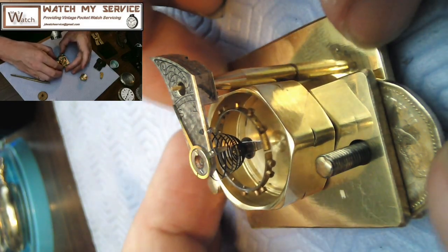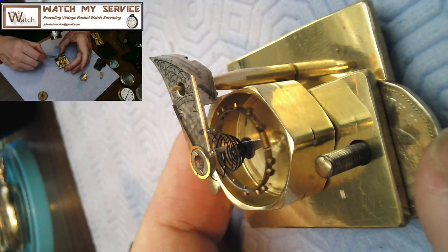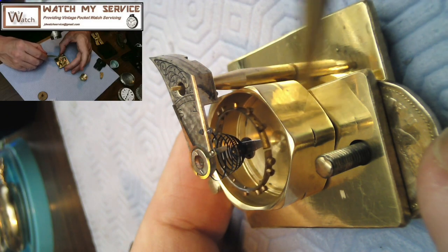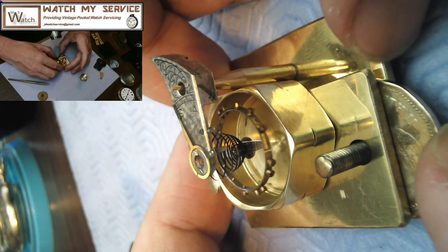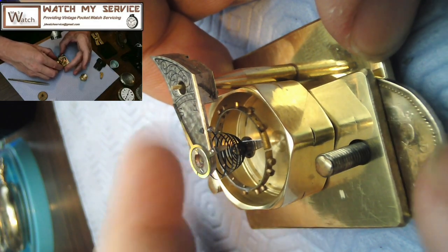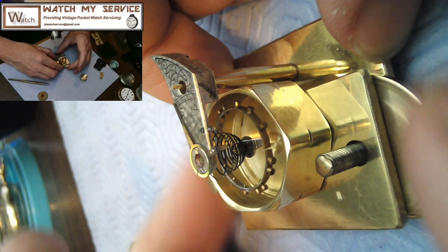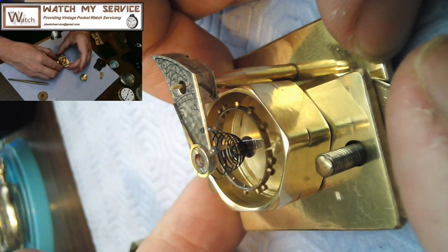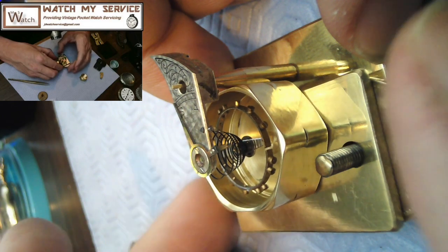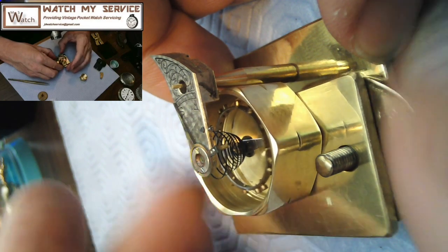When I want to lift the lift up, I would fill this completely with lighter fluid — pretty close to the top. There's a nice distance in the stop bucket so the balance will go all the way down without the pivot touching the bottom, but that's not dangerous anyway since you're doing it very slowly. As you can see, you turn the coins here like this and the lift lifts. You just take two fingers and go in opposite directions — it's a natural movement. As you can see, the balance is getting deeper and deeper into the bucket and therefore deeper into the lighter fluid.